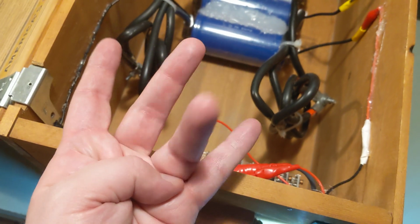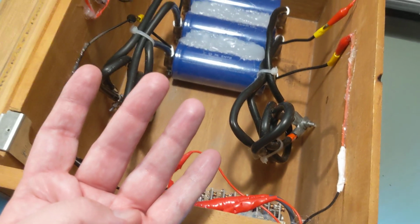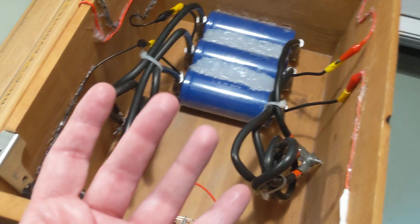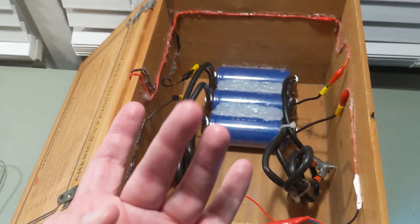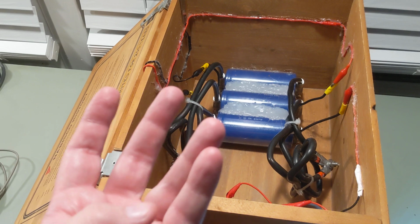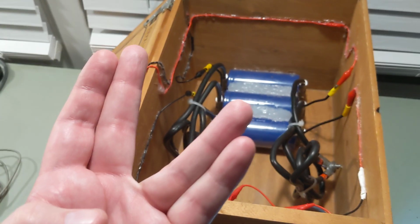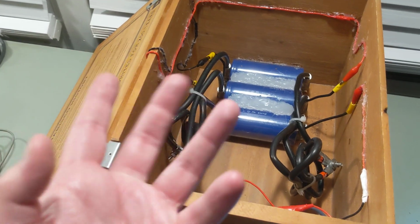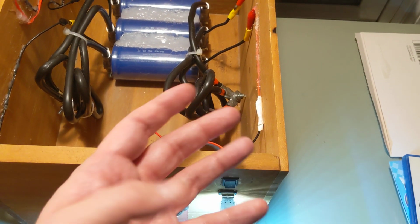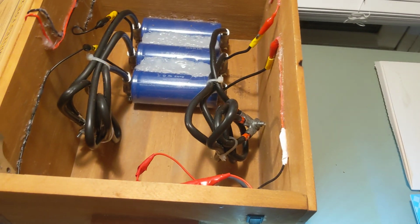Well, those data lines are actually used to control basically proprietariness of the USB cables, to say you can't charge your iPhone unless you are using an iPhone cable. And what they'll do is they'll put resistors between these two pins and these two pins, or they'll put them between these, or they'll mix and match and do weird connections with resistors. And then the charging device will actually detect, hey, what resistors are behind those 4 pins.